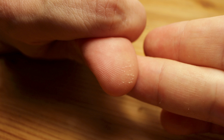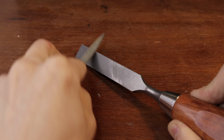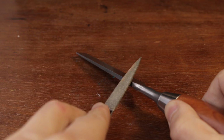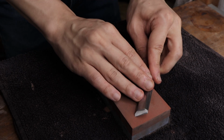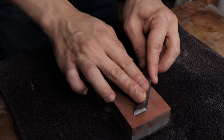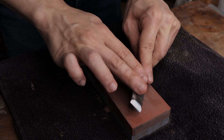And also, when you do some sharpening, you'll sometimes find that there are some light cuts on your fingers. It is because the square edge of the blade is actually sharp, and your fingers got cut when you're holding the tools tight. So when I get a new blade, I will usually use a file and sandpaper to polish the side edge a little, or even hone the sides with my 240 and 600 grit stone to round the edges a little so it won't cut into my skin. And also, be careful that you don't cut yourself with the main blade here when working on the edge.